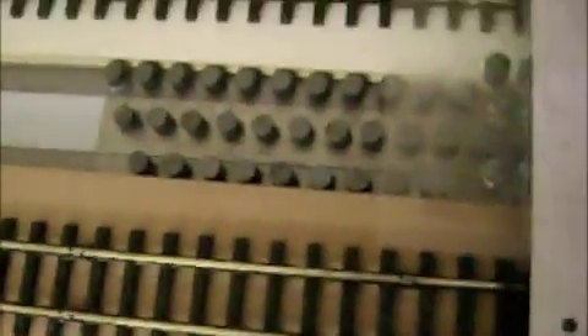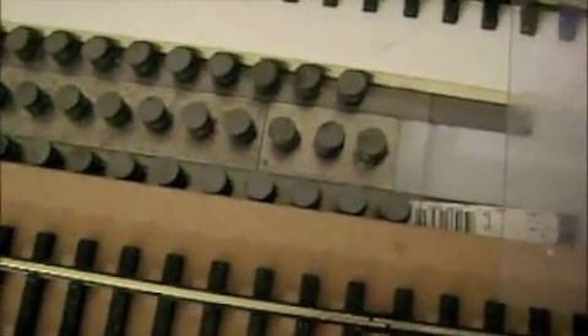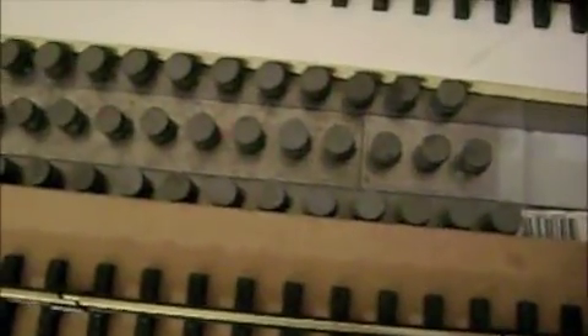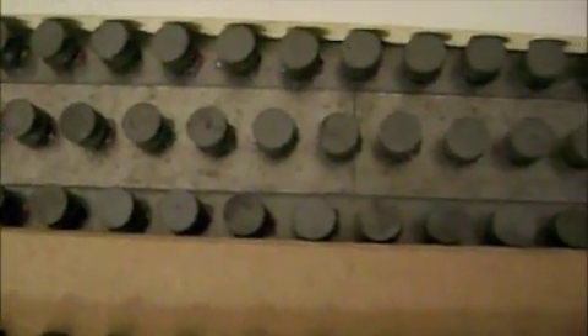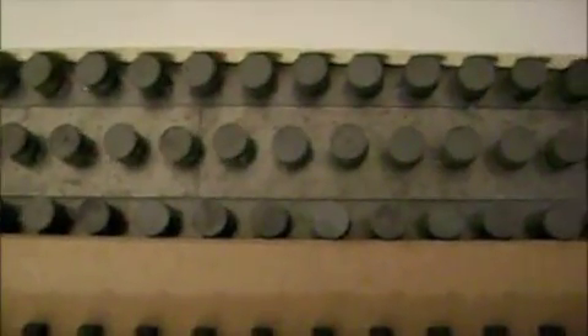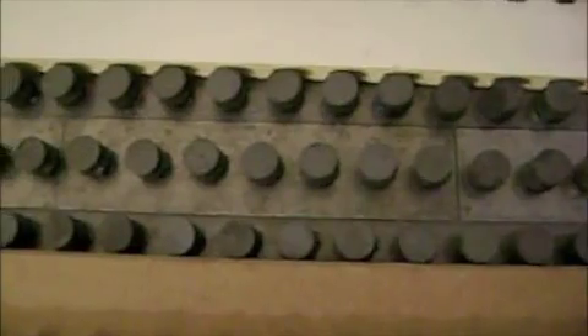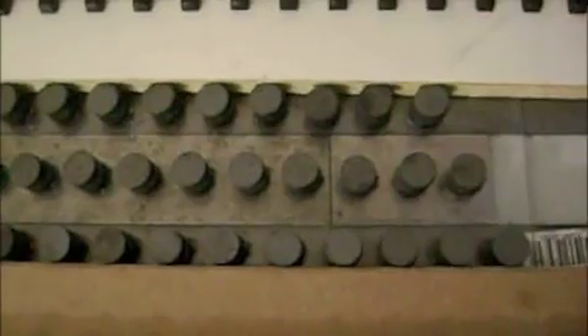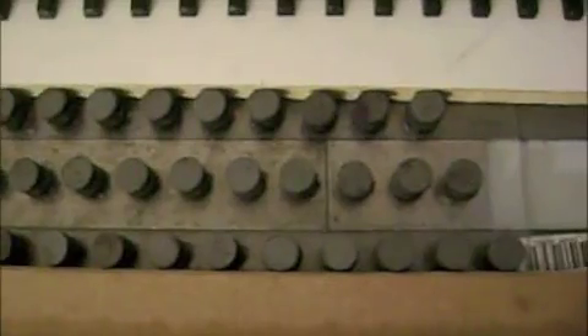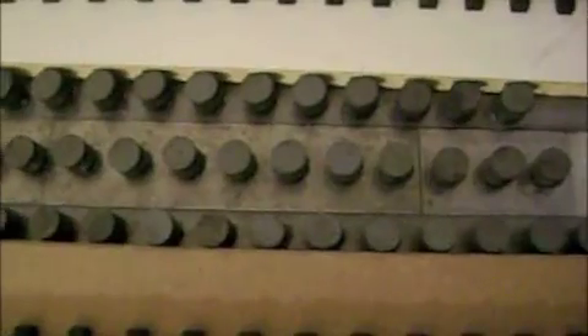There are some other things I'll play around with on this and see what I come up with, and if anything comes out favorable I'll post it later. The reason I did the staggered arrangement on the track instead of on the cart is because that's one of the few constants with the pictures and videos we have of the Paradev. The specific arrangement really doesn't vary in the designs at all. By setting them up this way — and they are angled — it's a lot easier to experiment around with how the magnets might have been put together in the stator assembly, just doing that on the cart so it's easy to flip them around and change the orientations.